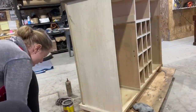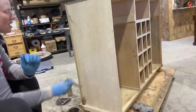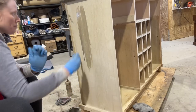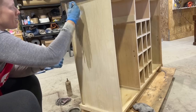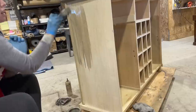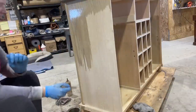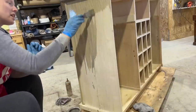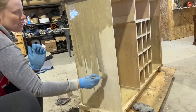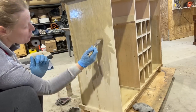Many people have asked me, why are you so hard on your brushes, going sideways, not doing nice, even brush strokes? So, the only place that nice, even brush strokes are really important is when you're putting your finish on. It does not matter if you are using a wiping stain, what the heck you do with your brush. You can go sideways, you can go this way, you can go like that if you want,